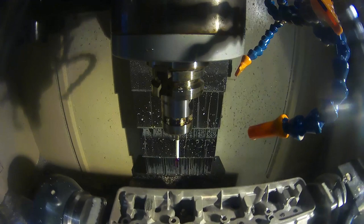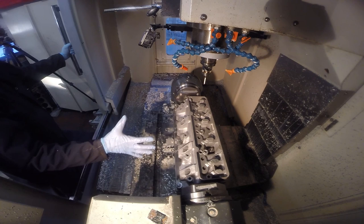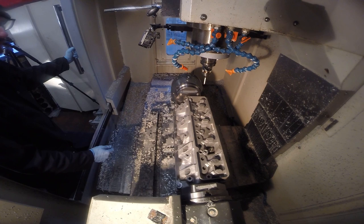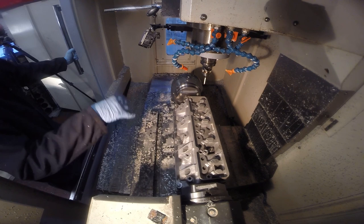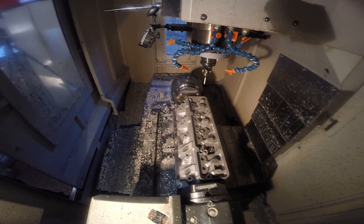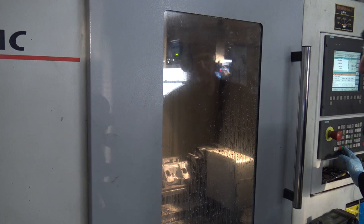The first thing the machine's going to do is just take off these tall stands that have been left on for casting. Sometimes the castings come to us without them, and they're machined down - fettled down, as the casters call it. These ones haven't had that done to them, so we've just got a little subroutine that we run with that. We won't show the whole thing, it's a lengthy process - we'll just knock them down, and then I'll start describing what the machine's doing after that. So just select the right program, execute that, and hit the go button.